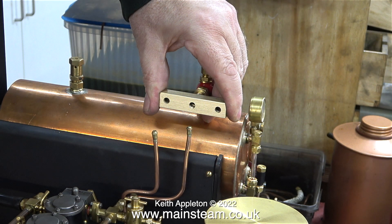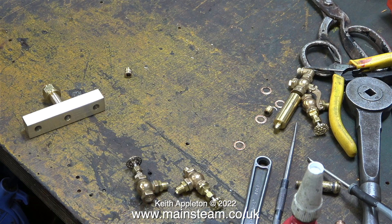After fitting the turret to the steam valve on top of the boiler, it was time to immediately remove it to fit the steam tabs in the front of it. I didn't polish the turret; instead I used some fine wet-or-dry sandpaper to get a good finish on the metal and then I used some Scotch-Brite to get the final finish.